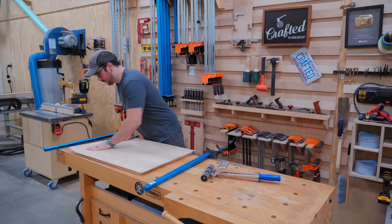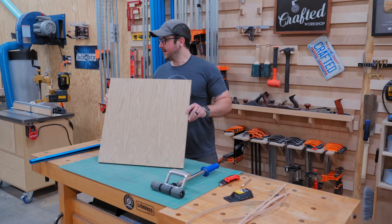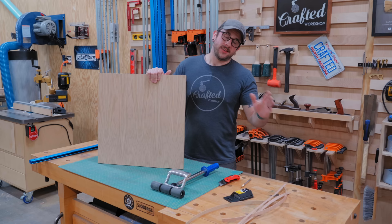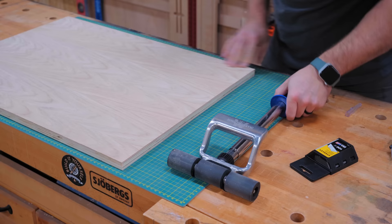After 15 minutes, this seems to be working much better. I'm not a huge fan of this particular contact cement - I've had this issue before where it dries so quickly you don't really know exactly when to put the surfaces together. The reason I like it is because it has a lot less fume, so it's a bit of a trade-off. Your traditional contact cement, which smells like death, definitely works a little bit better. I'll repeat the process of trimming the edges flush with just a utility knife - it cuts super clean since it's wood veneer and you don't really need to use a flush trim bit.